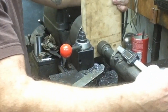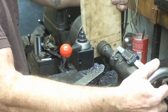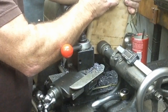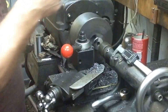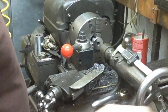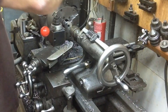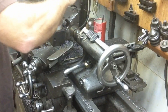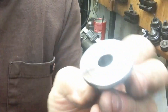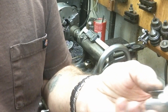It flattens them off. So if you want smooth faces to match up, they'll adjust a little bit easier and they're pretty smooth. All you do is run your 320 paper in there and work it around — you want to make sure it doesn't get away from you. But that will flatten out your surface. I've already got this surface pretty well done — this is the nose piece on it. It looks like that right there — polished up with 320.